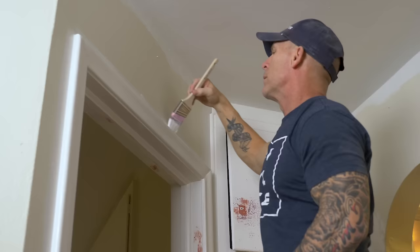It doesn't take very long. Some people think they can brush and roll trim faster than masking and spraying — I'll argue that, but it all depends how fast you are brushing. When it comes down to most finishes in new construction up here, the standard is an automobile factory-like finish — and the only way to achieve that without brush strokes is by spraying. I've got those two sides of those door jambs done and I'm going to continue on the opposite side.